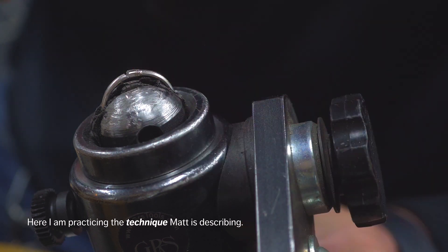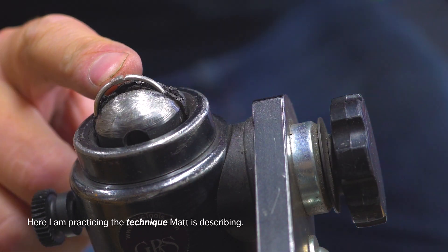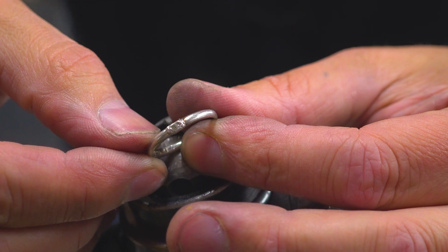Sizings — it's all about technique. If you just butt things end to end and go all the way round, that's where laser welding got a stigma of brittle joints, because it's hollow in the middle. So that's where you file a V through — either side of the piece you're putting in. File all the way through so you end up like this, nice and sharp at the bottom. Tack up the bottom, then fill with laser wire or drawn-down metal, building it up from the inside with solid metal. Add a layer of wire, take the wire away, hit it down with the laser to compact it, making sure it's nice and compact within that joint — the last thing you want is air pockets.